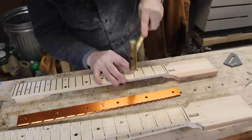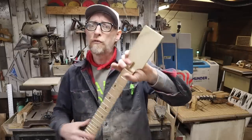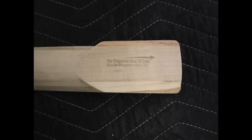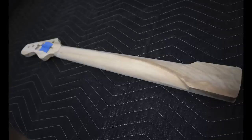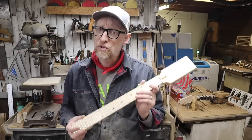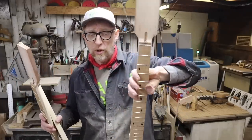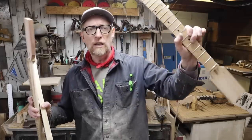This one is just a little bit high right here — seat that in a little, there we go. So that's how you go from those digital files to having a neck blank ready to get finished and made into a guitar. These are not completely done — there is still a little bit of fret work that needs to be done, some finish sanding, and these need headstocks carved out — but they're pretty close. You can see that if you take it one step at a time it's not as overwhelming as it seems to just look at a digital drawing and a block of wood. If you don't want to do this but still want to make your own guitar — I know necks are daunting for a lot of people — I'm stocking these at newperspectivemusic.com so you can get me to do this work for you and then do the easier and more fun stuff of making the body.